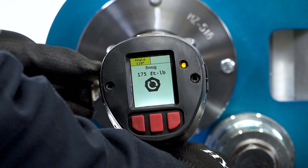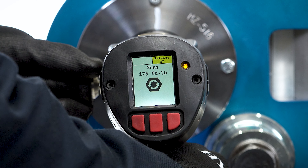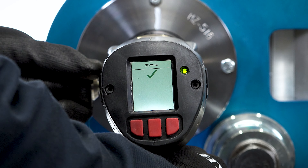The second step in PIV testing for the turn of nut method is pre-tensioning. For this step, the assembly is further tightened using the angle of rotation specified in table 8.1 of the RCSC specification.